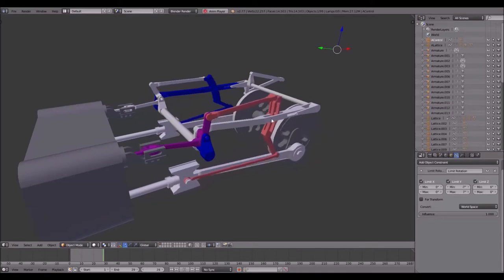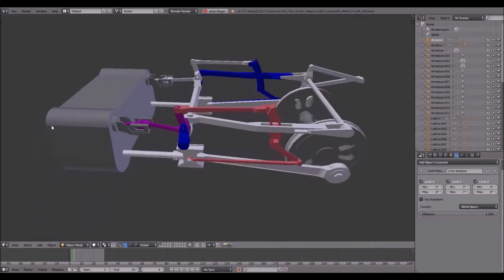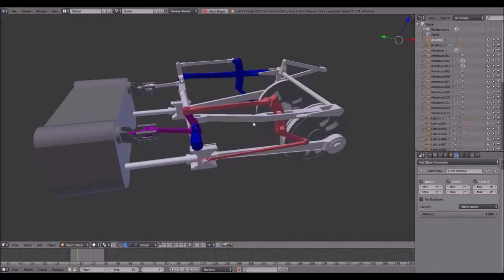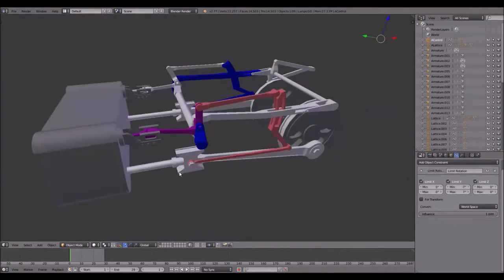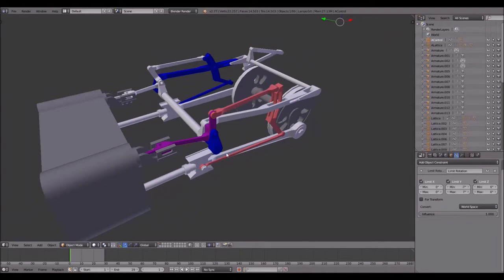I've used a bit of a strange color palette here because it's easier to understand the flow of motion if the parts are colored. For this explanation I will use the left cylinder. The crosshead — or both crossheads — move the wheel and are offset by 90 degrees on two-cylinder locomotives, which is the case here. The crank points down on one side and to the left on the other — an offset of 90 degrees. The valves and pistons are also offset by 90 degrees. So the Young Valve Gear uses the piston motion of one side to move the valve on the other side, and also uses the crosshead motion of one side to create the lap and lead motion on the same side.